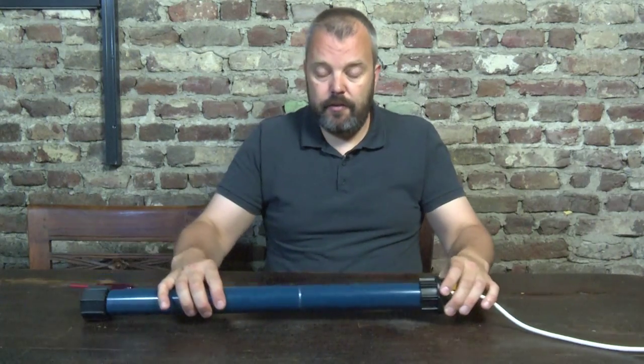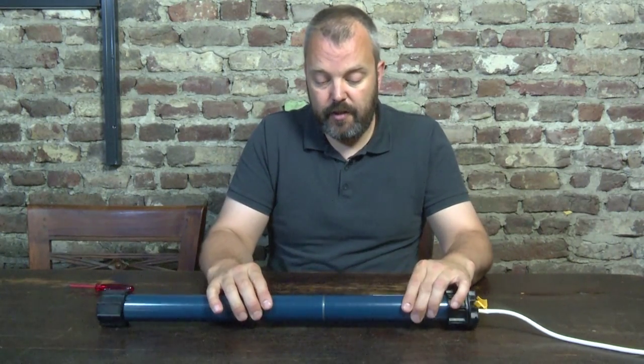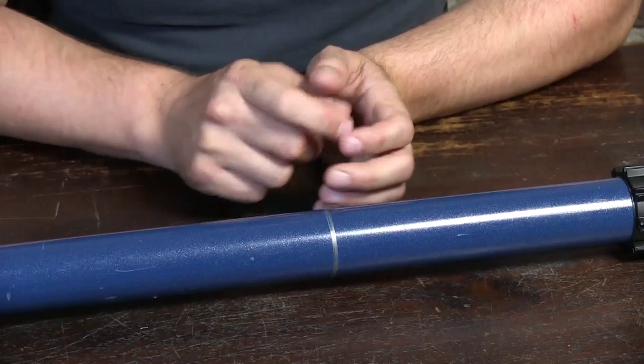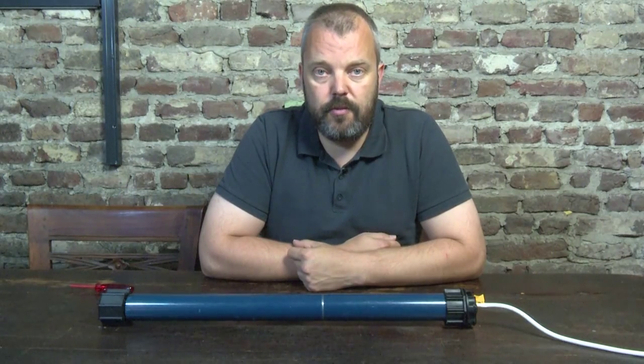The third thing is, as you can see here, there's a scratch on the tube of the motor. That's because a screw has been driven into the outer tube — the tube that surrounds this motor — too far, and it has damaged the motor itself with each revolution. The end result is that if the screw goes in too far, the motor will end up in two halves, completely damaged. Also, a scratch like this completely voids the manufacturer's warranty. You generally have a five-year warranty, so make sure that no screws or anything else can touch the motor once it's installed in the tube.